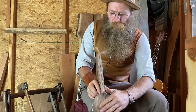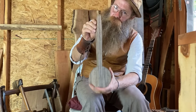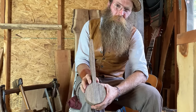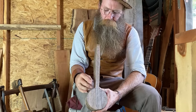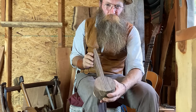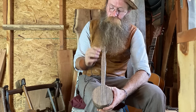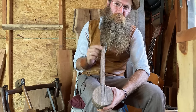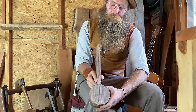When we're carving this spoon, we are going to work one dimension at a time. You can see we laid it out and cut out this one dimension — we're not caring about the other dimension yet, only this one and the 90 degrees. When you work one dimension at a time you cultivate these crisp ridges. These crisp ridges are what enables your eye to see any impurities. Even on the video you can see pretty good flow, and if there's a hump or bump somewhere you'll be able to see it because those sight ridges allow your eye to catch it. If we had worked three-dimensionally, all that would have been rounded off and you couldn't see those sight ridges.